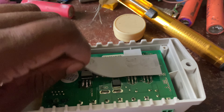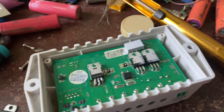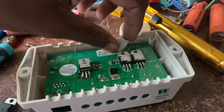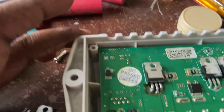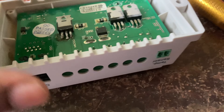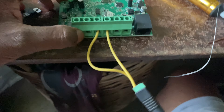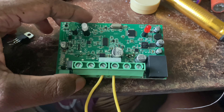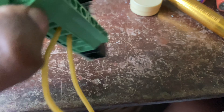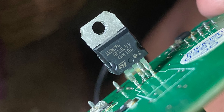Remove the separating thermal pad and this white thermal pad — it's the sensor for the heatsink of this charger. Here I have replaced the damaged MOSFET with my alternative MOSFET, the IRFZ44N. I have attached a 12-volt barrel jack to the battery port to check the circuit board.